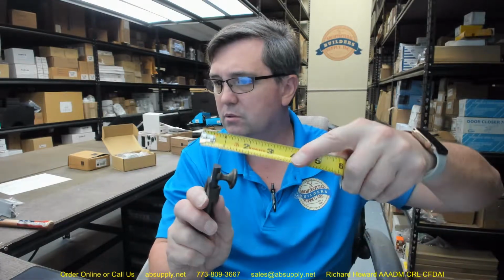Inch and 3/16 overall projection, it appears. Maybe about an inch and 5/16 overall projection. Oh, I was right the first time. About an inch and 3/16. Yeah, right. Okay, sure. So looking at the drawing there. Dimensions on drawings, I like to double check them when I have the hardware because they're never completely exact. In lots of instances with Hager, and occasionally they're wrong. Very occasionally. So we do like to double check it.